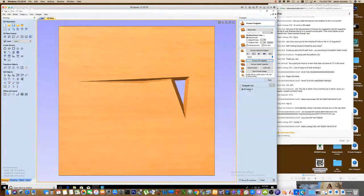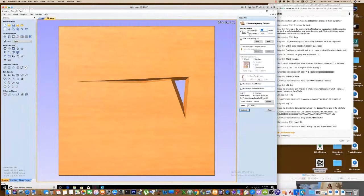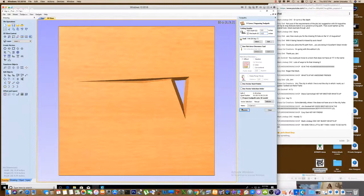So it'll clearly go all the way through to a depth of 1.2, and that will cause an error in your machine. So obviously the solution, maybe not so obvious, is to create a flat depth of say 0.2. Now keep in mind 0.2 gives you 0.05 on this area. It'll be 0.05 and it'll be 0.2 of depth. Let me explain this a little better.